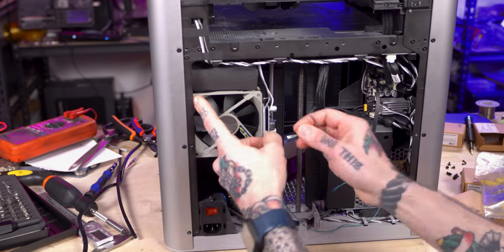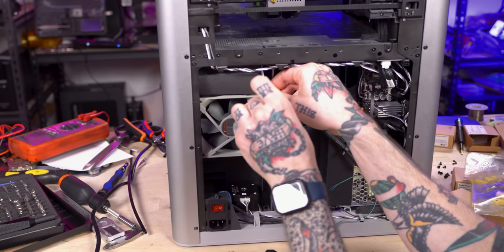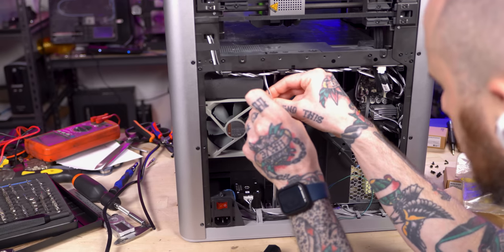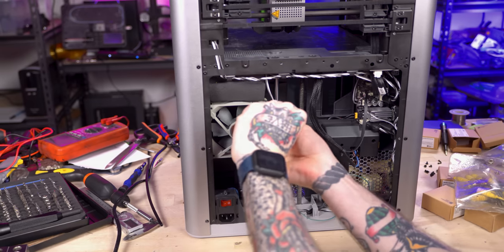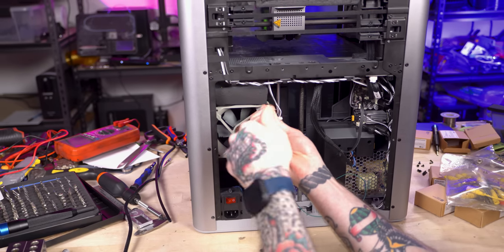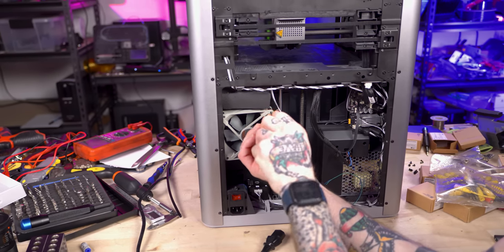I have to physically install the fan so I can have it mounted up and make the connections for the TAC signal and PWM signal. Doing this in place is just going to be easier than pulling the entire harness out and doing it outside of the machine — it'll let me see exactly where the wire lengths need to be. Reinstalling the chamber fan is pretty annoying because it's hard to get to the screws, and you have to pass through the outer side of the fan through the hole to reach the hex screw. It's a challenge.